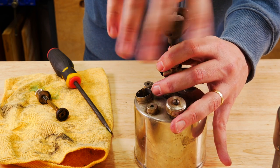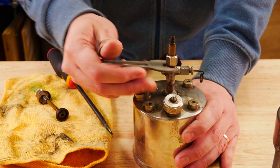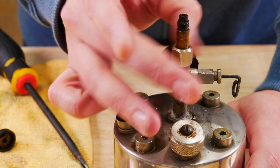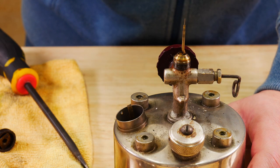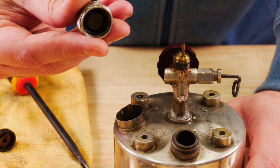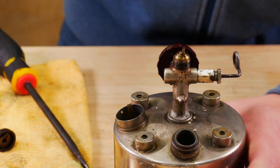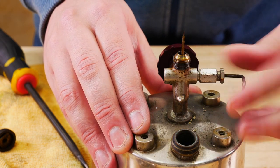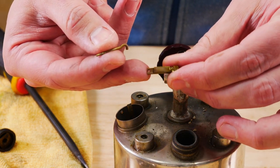Just take it off the bell here. You can use the tool that comes with the kit for almost everything if you'd like. Just getting off the generator here and the vaporizer tube. There's your cleaning needle. Just taking off the fuel cap — this piece here, which is the little knob that controls the cleaning needle, is kind of my main problem. It is rusted in place and does not want to turn very well. There's our little eccentric block and the cleaning needle.